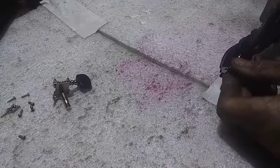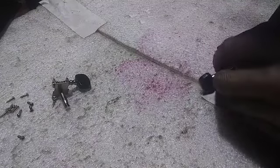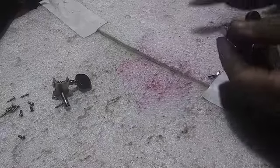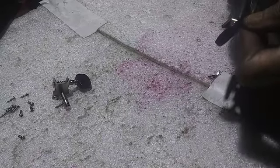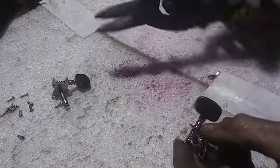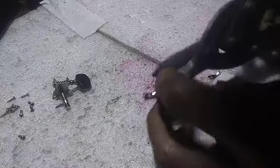Well, it was easy to do it with a right-handed tuner, but there we go, sorta. Sorta, kinda. Not so easy with a left-handed tuner. Yeah, not nearly as clean. Need left-handed aviation shears. They do make such a thing, actually. These work well when you're cutting a circle one way but not the other. And so they make left-handed ones that work when you're cutting a circle the other way.